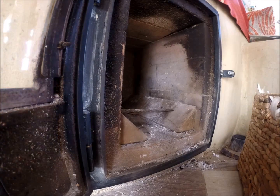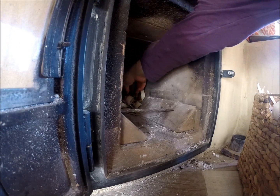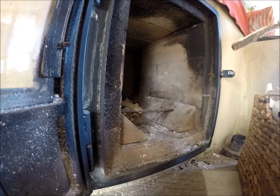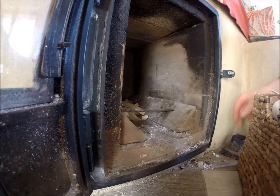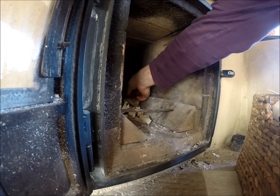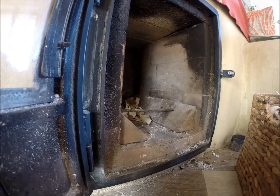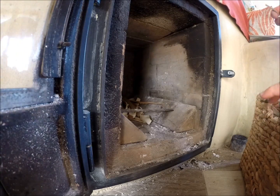The inside surfaces are usually almost hot to the touch when I start to fill the wood inside. This is about 8 hours after the morning burn. First I put a handful of wood shavings from woodworking on the floor of the bench box, just in front of the port but not into the port. I put some additional shavings towards the door so I can easily reach them with the match in the morning. Over the shavings I add slightly thicker kindling — about 5 pieces of splittings does a great job to transfer the first flame to the main thicker wood.